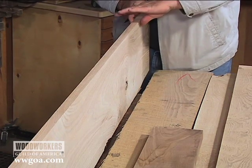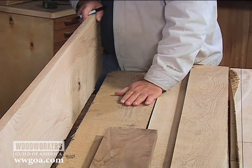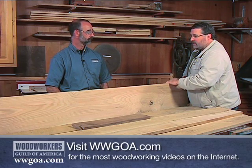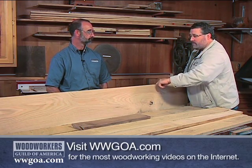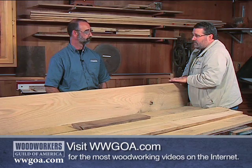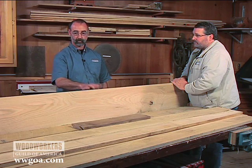to your desired thickness. So when you place an order, we may have brought it in rough, surfaced it to hit and miss, and then when you place your order, we will ask you what thickness you're looking for. You may order it right to 3/4. Some shops will order 25/32. It allows them to glue a few pieces and sand a few pieces and still end up at a 3/4 thickness. My own recommendation is 13/16.